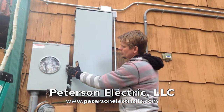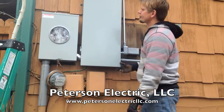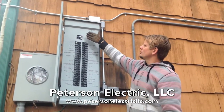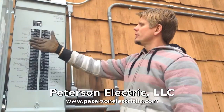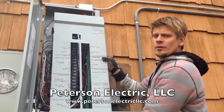We've got a brand new meter, underground fed with a slip sleeve to our new panel, 200 amp disconnect. Main disconnect at the top meets fire department and city code. It's a Siemens panel right here. There's our dead front cover.